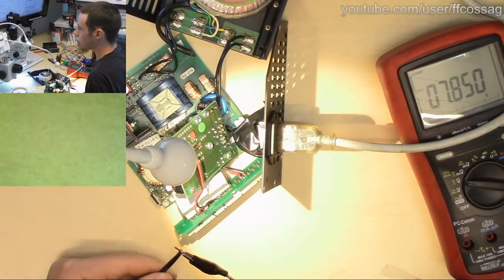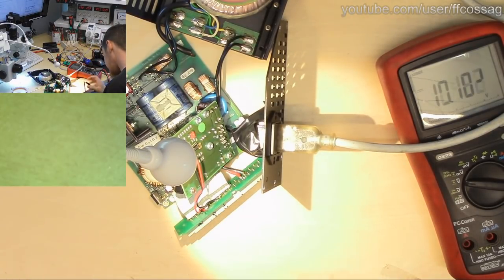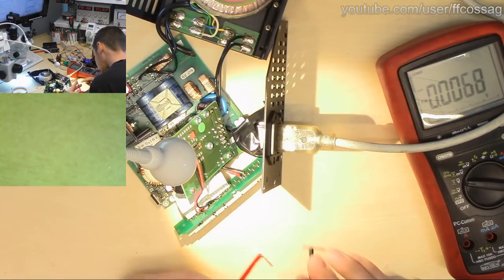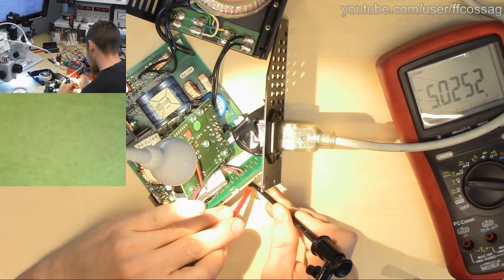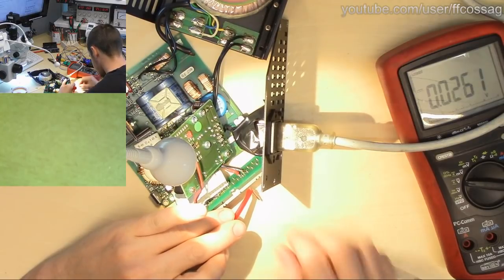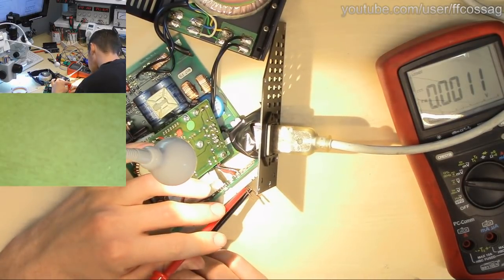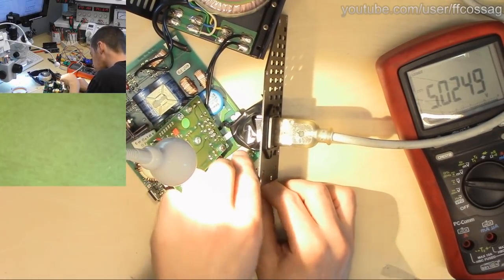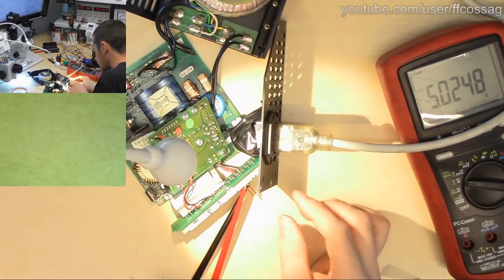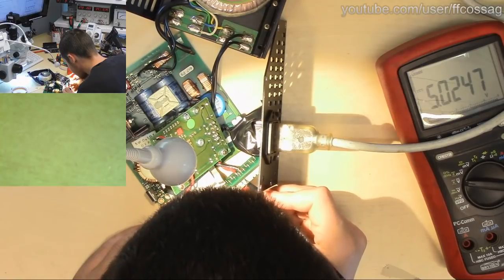So we are plugging in and we are turning on. So we are now powered by live mains voltage, and we should have some output voltages. Let's see what we can find. It should be somewhere around here. There we go, 5 volts, first try. There we go, let's mark those as well. 5. Ground.